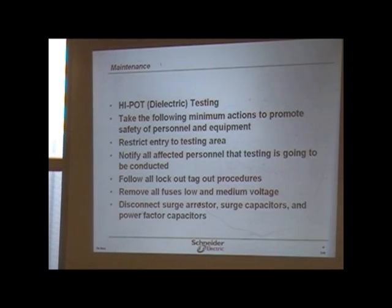These in turn feed other transformers that are going to go down to your 480, and now you're going to have a breaker that's a main that now feeds other breakers, and that in turn would come back over here and feed MCCs that of course are going to be three phase and everything else. You're going to have more loads here that actually go downstream and keep going further and further downstream. Okay?